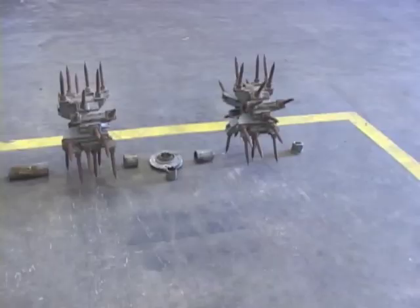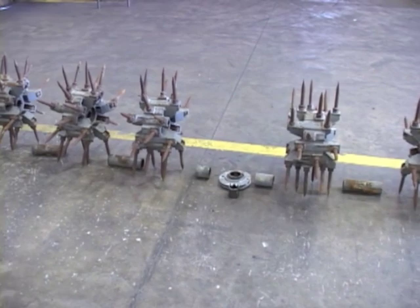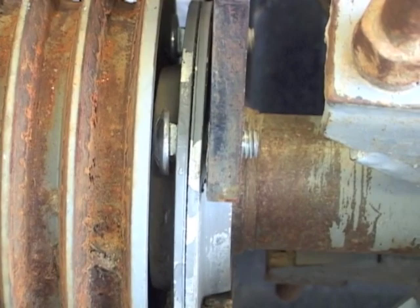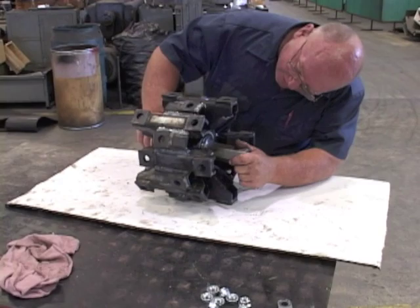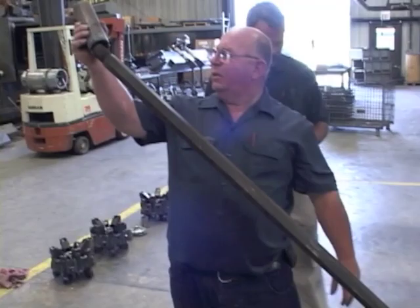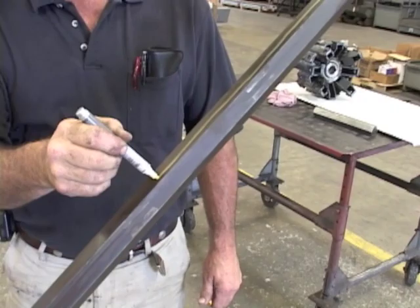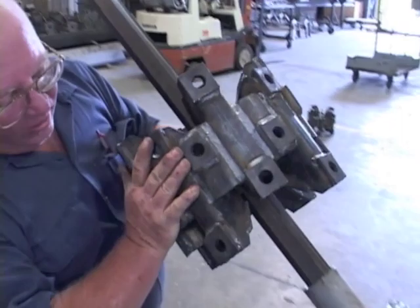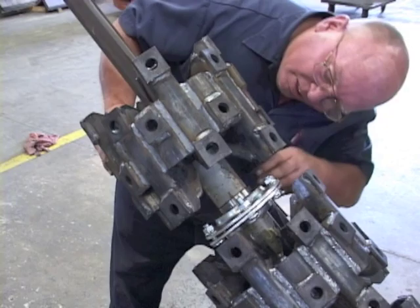With all the necessary parts laid out in order, start the assembly process. If shaft hanger bearings are replaced, make sure to put carriage bolts back in the flanges next to the pulley as shown here. Before stacking the rotors, reacquaint yourself with the timing marks found on the adapters. If there are existing rotors on the shaft that were not part of the repair, find the timing mark on the adapters. Use a marker to indicate the two flats of the hex shaft being used by the timing marks of the rotors. When sliding the spacers next to the rotors, make sure they properly seat themselves. These spacers must be fully seated against the adapters or damage will occur. Before sliding the repaired rotor down the shaft, double check to make sure the leading timing mark is on the proper flat.